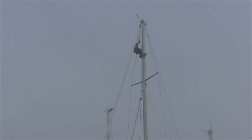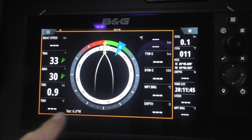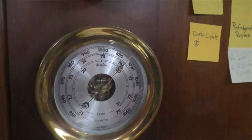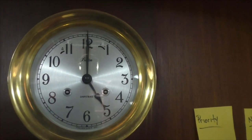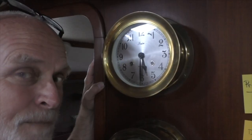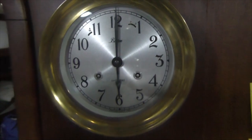Here's a good morning routine to get your adrenaline going. The anemometer is working — that's where the wind is coming from and it's only one knot right now. Most boats still carry a barometric pressure gauge. And this clock is not your normal clock — our shifts are four on, four off, which is pretty common. The shifts are 12 to 4, 4 to 8, 8 to 12, and around the clock again. This clock tells you where you are in your shift — two bells means one hour has passed since the beginning of your watch. This is the bottom of the hour, and one and a half hours passed. A lot of boats have clocks but not that fancy ship's clock.